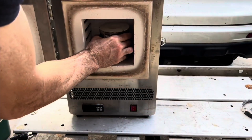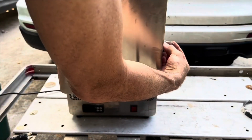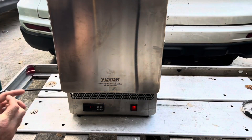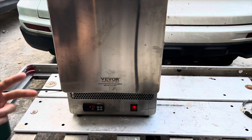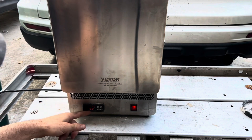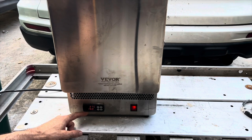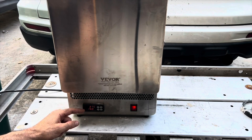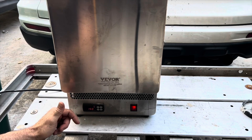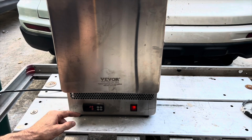Take our cast, put it in there, equal distance from all the sides, and lock that down. This is an electric kiln. We'll keep this at 150°C for two hours, and we'll do each one of these phases at two to two-and-a-half hours. The next phase we bump up to is 350°C for about two hours, and then we jump up to 700°C — normally anywhere from two to two-and-a-half hours — and that's really your burnout phase. Then we've got to cool it down, normally about two hours, and bring it back down to 200–250°C, and I do my pour.